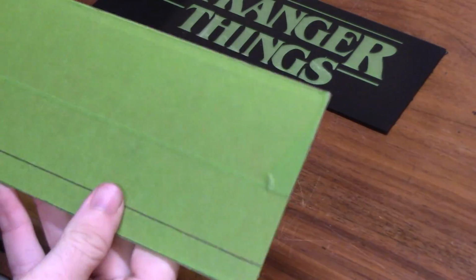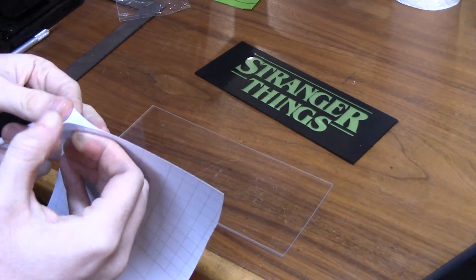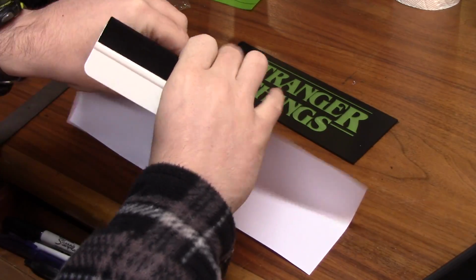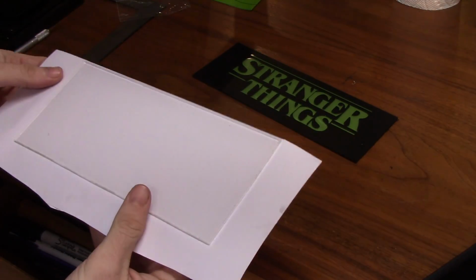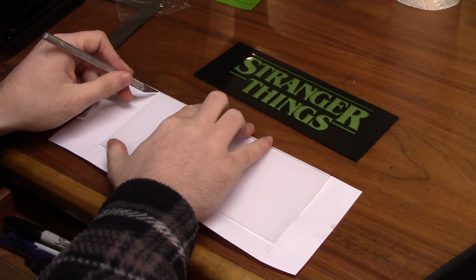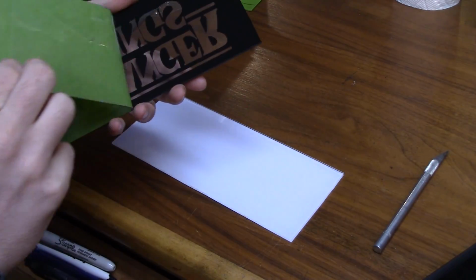Getting your acrylic panel to be backlit is a little bit tricky sometimes, just because light will sometimes leak through areas of the panel that you don't want it to. For example, usually your LED strip will be right up against the acrylic panel, and so if you didn't put enough coats of paint on the front of that panel, sometimes that LED strip will shine through the painted part of the panel, and obviously that's not a good thing because you are trying to get this thing to look a specific way, and if the light is just doing whatever it wants, then that's kind of a bad thing.